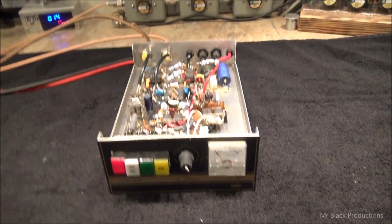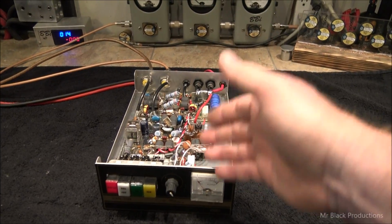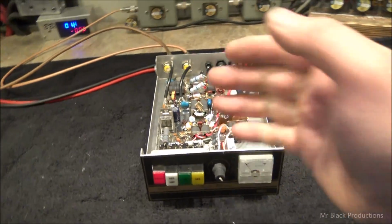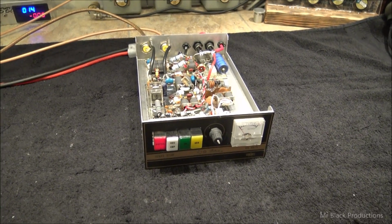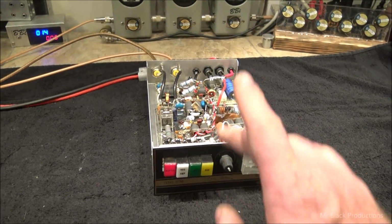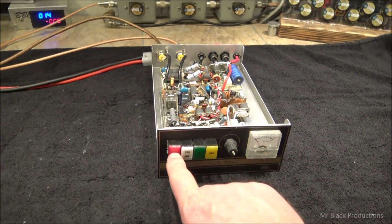More fun stuff to come. Okay, Jason, buddy, you're all done, man. Here's your 667. The one-pill driver has been put in. The power wires have been modified. The ground wire has been modified. It has been turned over to Class C. And this thing is an incredibly sensitive little guy. No more than 1 watt dead key, and I'm going to show you why here in just a second.